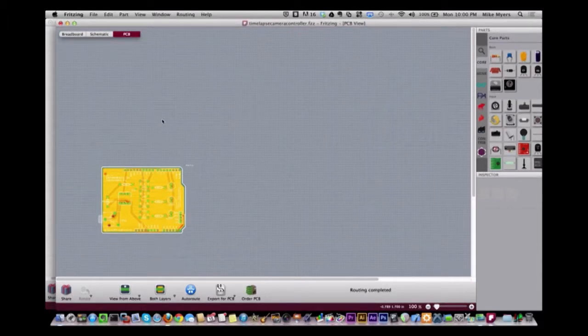All right, well, we're going to go on forward. No reason to hold everybody up for this, but it does do a design rules check, and it'll highlight on the board where it has concerns and give you a list of things as well, and you can go in and make changes. It's kind of weird that it itself does things that are not in the design rules, but it's easy to fix them, so you just go find them and rearrange things a little bit. And it does do copper and ground fills too. The board I was just showing you is copper ground filled.